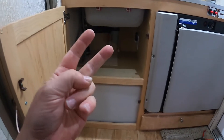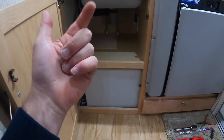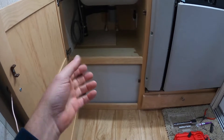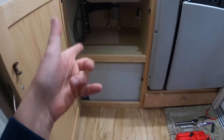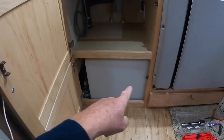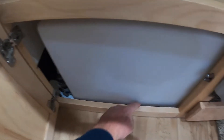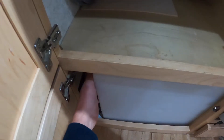Okay, here we are — this is part two of our 'move the water to the basement' video. My name is Mark, this is my 2015 TAB Max S trailer. In the first video I talked about the plan; in this video I'm going to start actually doing some of the work. We're going to disassemble a lot of this, but in general we need to take this water tank out first. To do it, this bottom strip needs to come off — there are some pocket screws on either side, some hose clamps to take off. When I put the bigger sink in, I put in a really nice access panel to the back so I can get to all the hoses behind it.